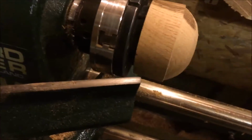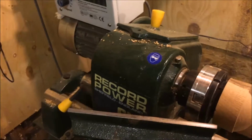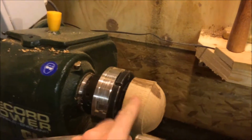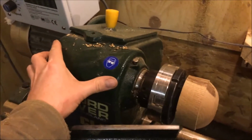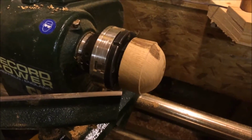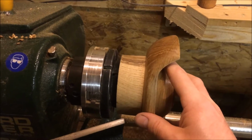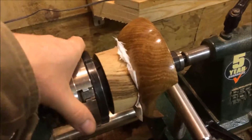Now it's very important that, if your headstock rotates, you line up centres. So move the live centre in, before you do this, put a centre in the chuck, line them up by moving the headstock, so in perfect alignment, then move the headstock back out of the way, put the bit of wood in, and off you go. And that should be, when I put this bowl on there and bring the headstock up, that should be perfect. There we go. So it's all on there.